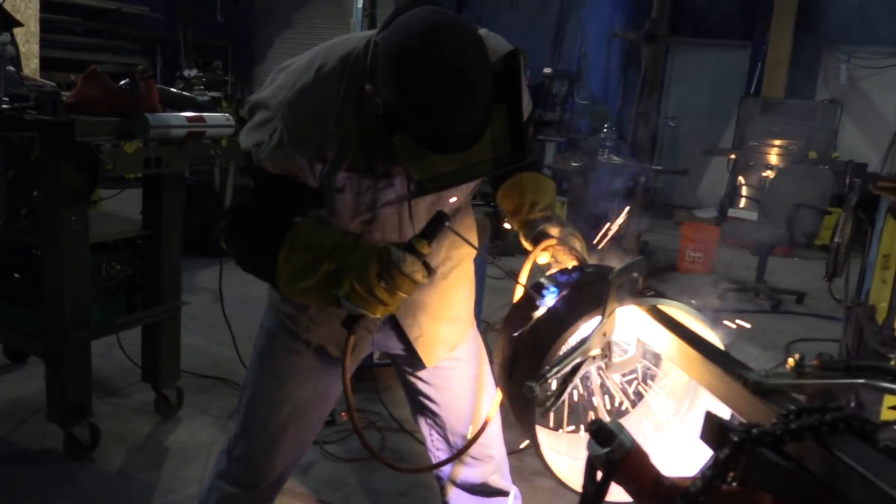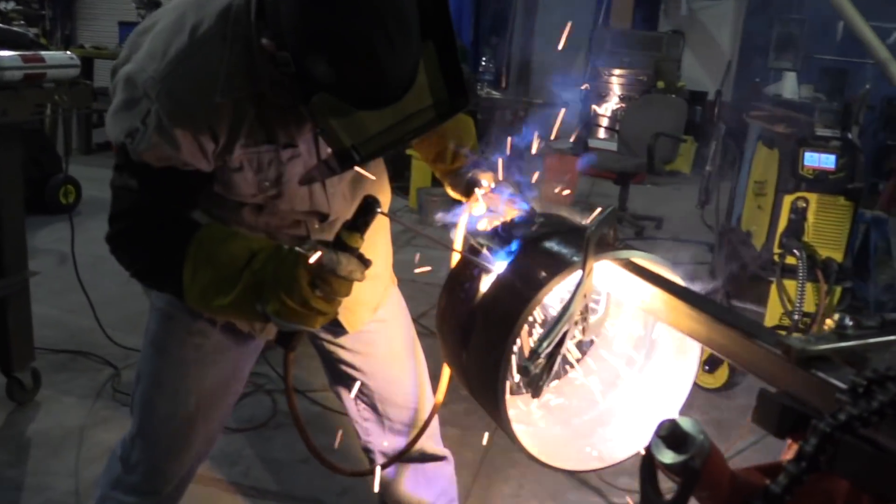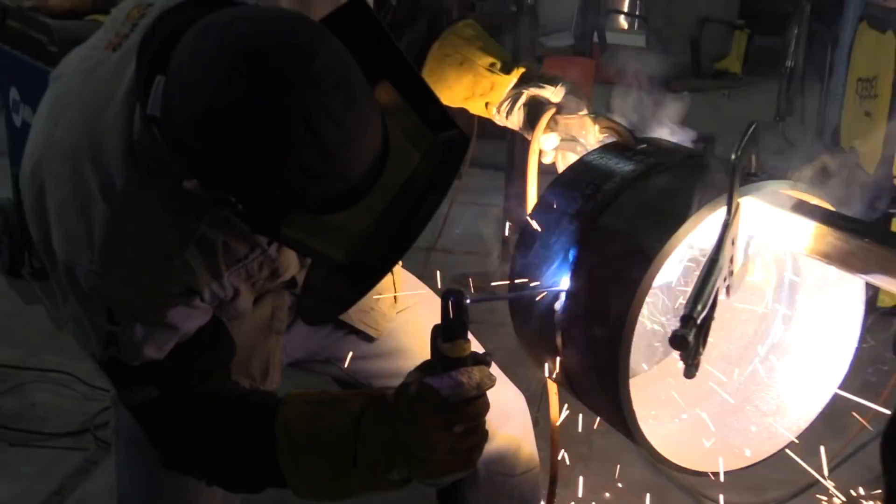Keep the angle aimed just about toward the center of the pipe. The keys are having the right amperage, the right pressure on the rod, and the right rod angle. Sound can help you too — you get used to a certain sound when the penetration is right and it's jammed in there nice and tight. There's a feel to it as well. You see guys on Instagram and YouTube — Bob Moffitt, Hamar, Egilo — they'll flip the hood up and grab a drink while doing this. You don't see much light on the outside when the arc is like it should be.